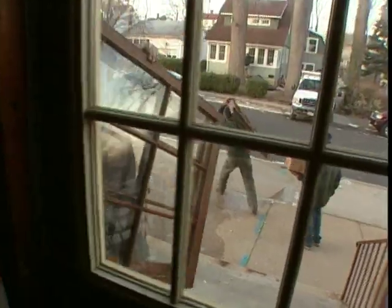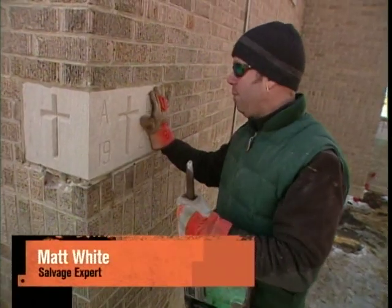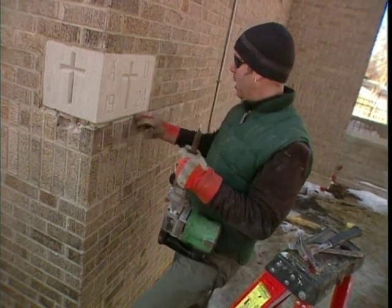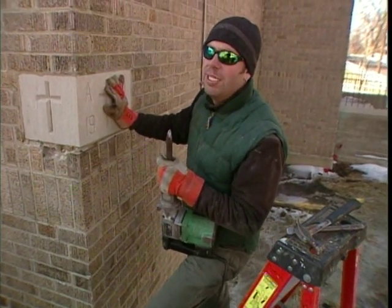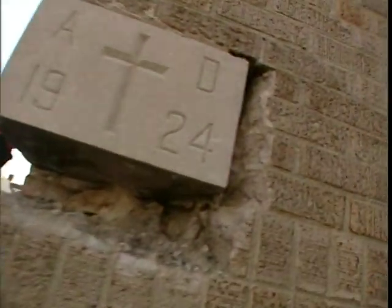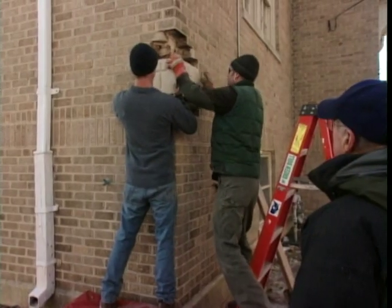Outside there's something I just can't wait to get my hands on. Here we've got the date stone, or cornerstone. We're going to take this out. Sometimes people would use these as a kind of time capsule, but you never know until you remove them. We're going to chip this out real carefully — not to chip the face of the limestone. Limestone chips really easily. I use a chipping hammer carefully around the box and place a support board underneath.